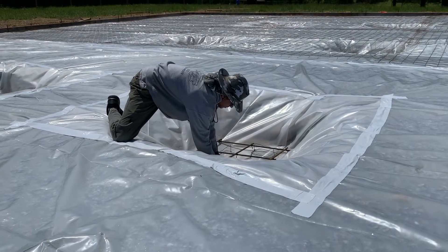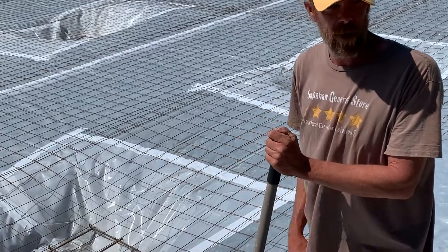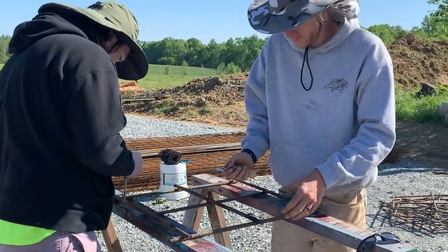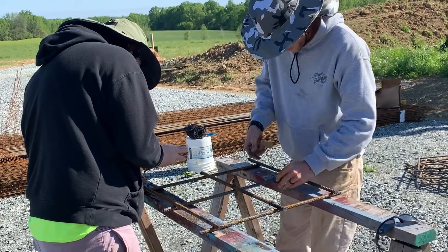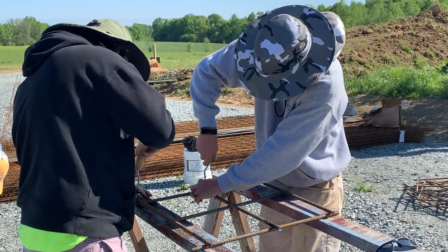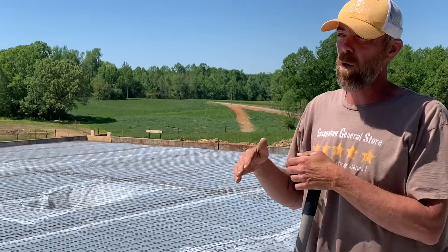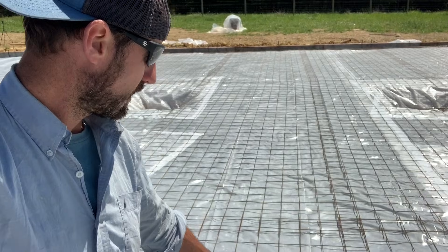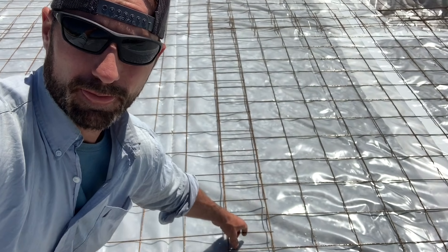Of course we had to put the plastic down and then we had to put the grid in there and get it situated before we can cover it with wire, because there's no way to get back to it after you cover it with the wire. Me personally, I like to set up some saw bucks to tie my grids so you don't have to bend over. This is number four rebar at the slab. We've got two runs going on the exterior footing, three each way and all the flow points, 16 inches deep on the footing itself with a four inch floor over top of that. We overlap our wire six inches or one grid each way, because if it doesn't overlap, there's a really good chance that it could crack where the remesh panels intersect.